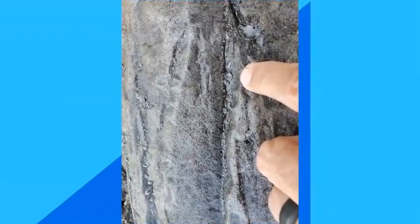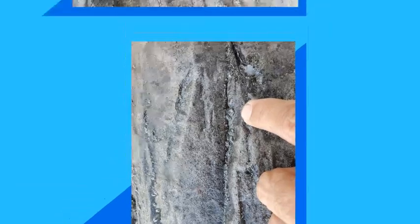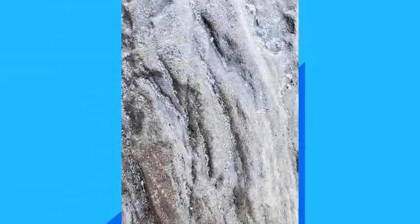Here's an example of some bubbling, and I did this on purpose the other day. We were testing some new stamps outside, and it was really hot. It was in direct sunlight, and I knew this was going to bubble. Just to get some cool pictures, you can see where some of that sealer settled in that crack right there, and you can see what happens to that when it gets really hot. It doesn't have time to cure, dry slower.